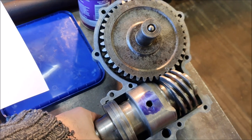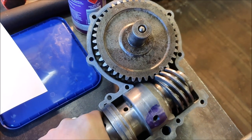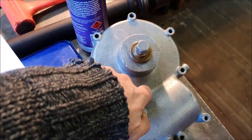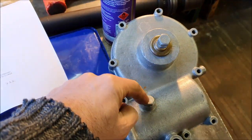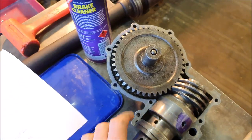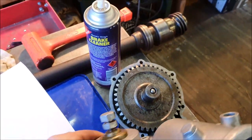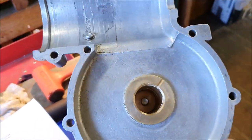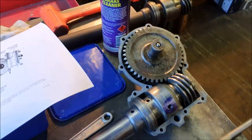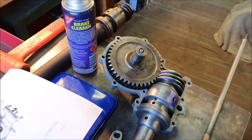What I'm wondering is can I just rotate this — which doesn't seem to be affecting the mesh of these gears at all — and drill a new locating hole. Obviously I can put the housing on and mark exactly where I need to drill that locating hole. There is an adjustment on this — this is why there's this bearing in here, and there's this adjustment screw on the other side of the housing which pushes through to take up any side play.